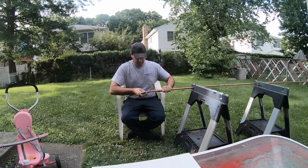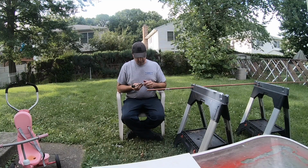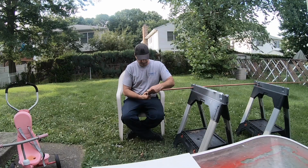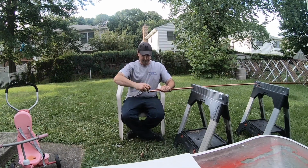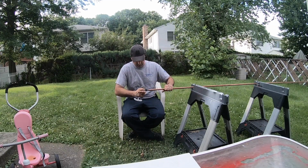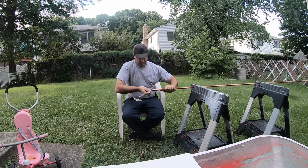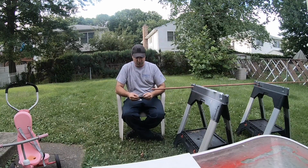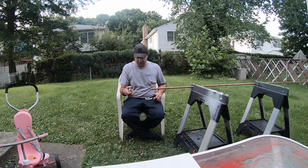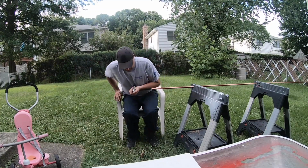Okay, so that's something I'm noticing: the reamer doesn't quite stay in place too well. It's a little scary, and you've only got this lift on this side. Let me get a new edge to cut. So I'm not impressed with the ream. Okay, that's good. Now on the Ridgid ream, see, that's not moving, and you can go in both directions with this. As far as I'm concerned, with reaming, Ridgid wins. That's not going to move on you. This, well, that's a little scary. Be careful of your hands when using this. If you're doing a lot of reaming, this is not going to be the tool you want.